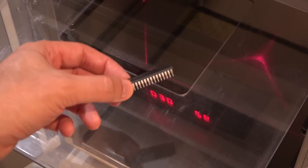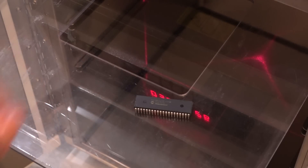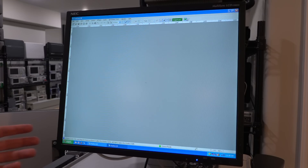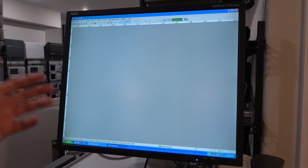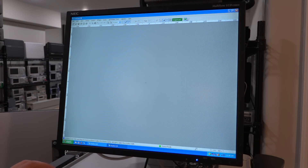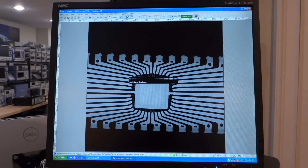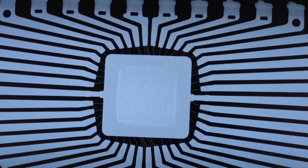I also want to measure the tube current — it should not exceed 300 microamps. Switching to current measurement and trying again: 0.299 mA — 300 microamps, almost spot on. Everything from the tube's operation is still consistent. Now the moment of truth: let's take a look at this package. There should be a die with wire bonds inside — wire bonds are quite fine and can only be resolved if the X-ray is in focus. Taking a fully automatic picture; the software analyzes contrast from a quick 26 kV shot, then decided to do a full exposure at 35 kV for about 12 seconds.